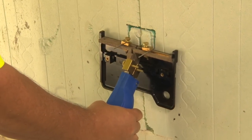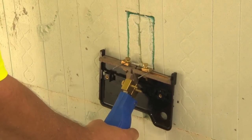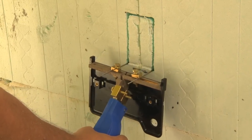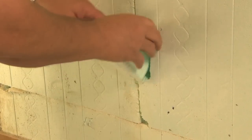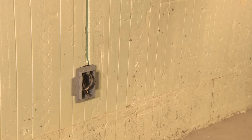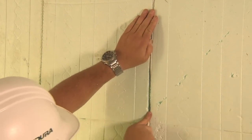There are a variety of methods for electrical box installations. A hot knife with a box attachment provides one of the easiest ways to remove the EPS. Once the location of the box has been established and the required amount of EPS foam has been removed, it's recommended to run wires to the box prior to anchoring the box to the wall.